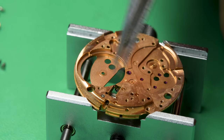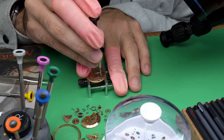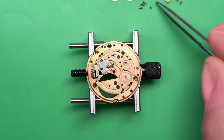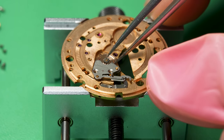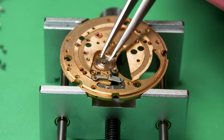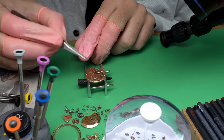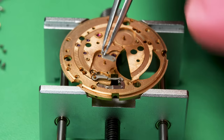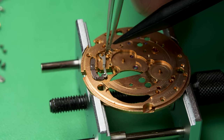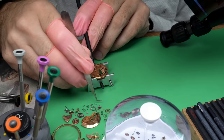It is important to have your watches serviced, particularly if you're planning on keeping them long term or passing them down to family members. What will usually happen is if you don't service them, they'll wear — and if they wear too much you can start to ruin parts and need more extensive care. Also when you bring them in for service, they'll replace gaskets to maintain water resistance. If you neglect that, you can get water in the movement — and if you've watched my channel, you've seen some pretty gnarly examples of that.